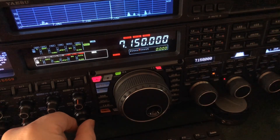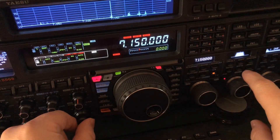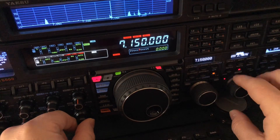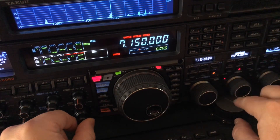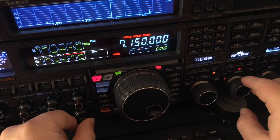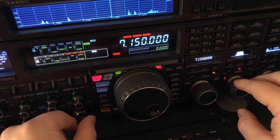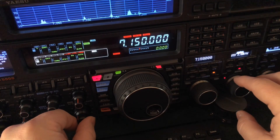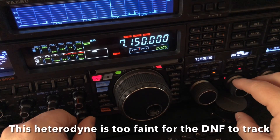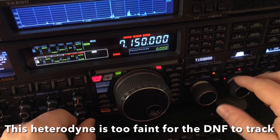It's gone now. That's because I'm at a 2.4 kilohertz bandwidth right now, which is the default. If you enable the digital width, you can narrow — you see the graphic there — or you can widen out to 4K. Listen to what happens when I go from 2.4 to 2.6. It's sneaking in there at 2.5.